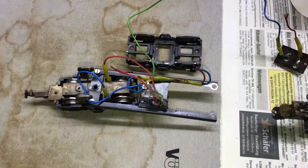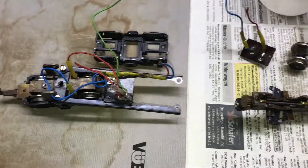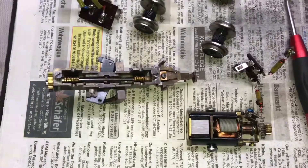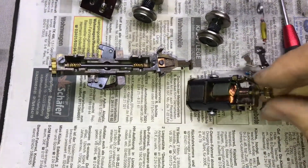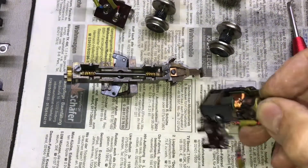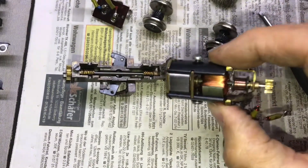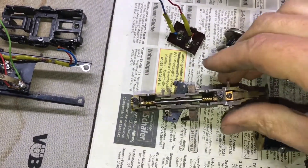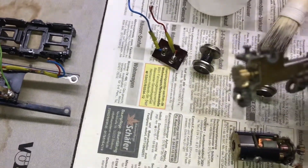In the first step, the loco is now completely cleaned, all parts disassembled and re-greased. The motor is already done - I have completely taken the whole thing apart and lubricated it. With isopropanol and brake cleaner, the whole armature is now clean, the gears are completely in order, and the axle I also disassembled. With the worms for the drive, I have the rear gears already clean.